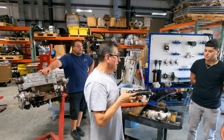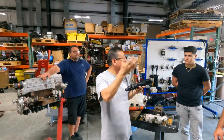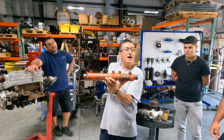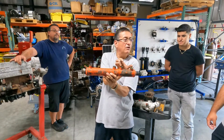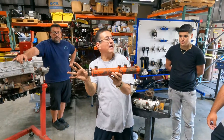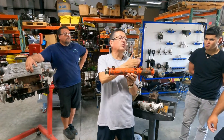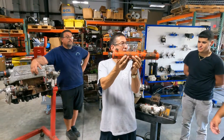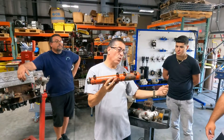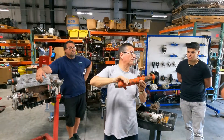How many heat exchangers were mentioned? Five or six. There are combined heat exchangers — in between these sections I have one for fuel, one for motor oil, and one for transmission. Some have five components combined, others three or two. This is done so you only have to run one seacock for the whole system, with one flow of raw water for all of them.